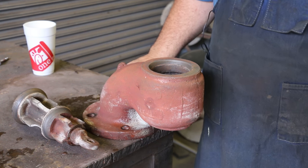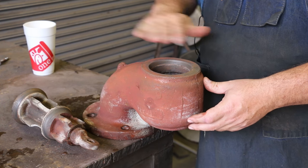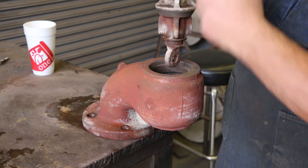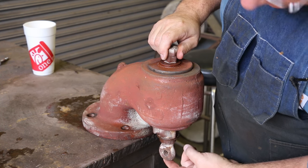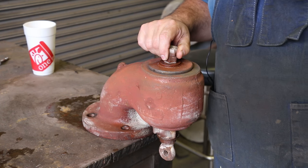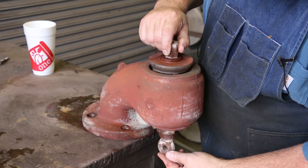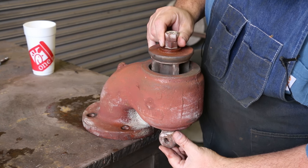Here's a more close-up look at the valve and how it works. This is up in the top of the steam dome. This flange down here will go to the dry pipes that go through the boiler — that's where the steam actually goes to the two engines on the locomotive, one on each side. It's a spool type valve. There are actually two valve seats in here, one smaller than the other. When you pull the throttle on the outside of the boiler, there's an arm that comes in here, transfers the motion, and pushes this valve open. The higher this thing goes up, the more steam goes in.